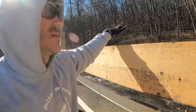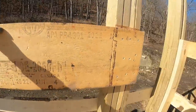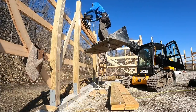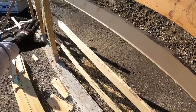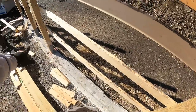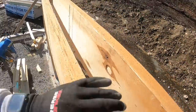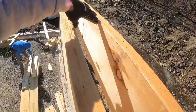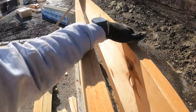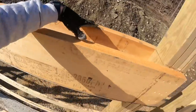So we got this double LVL header up. We put one side up on the ground. The other side we just put up now on the inside. And the reason we have to have this is because there's a big window right here. So we had to separate the columns out to 10 feet. And so we will have a stub column in here, which we'll make up right now, that will carry a truss. And then that will be transferred into these LVLs, and then the LVLs will transfer that weight into